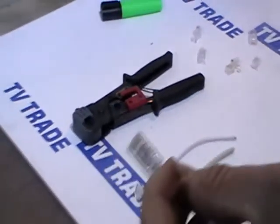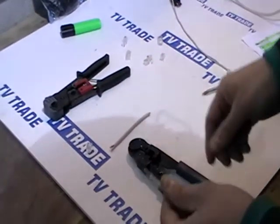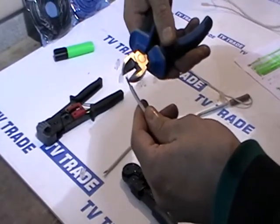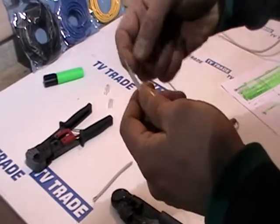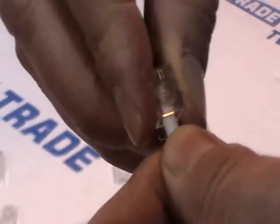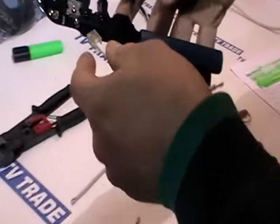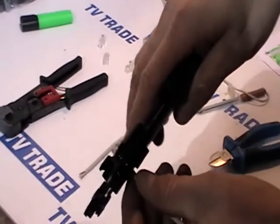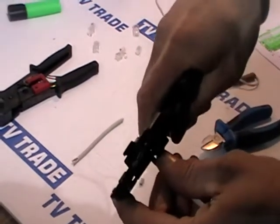That's how this tool is used with an RJ45. Now, if we want to show how it's used with an RJ11 and telephone cable: we cut off a small piece of cable and simply slide the connector on. There's no particular color code needed with telephone cable, so we slide it in, push it all the way through to the very end, crimp it down like this, and lock it into position. Once crimped fully, it's done.